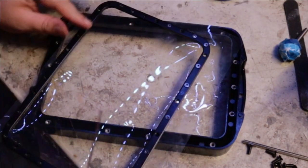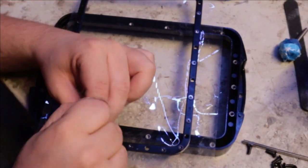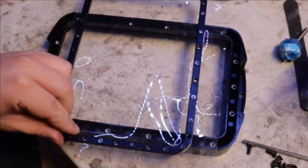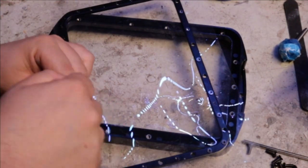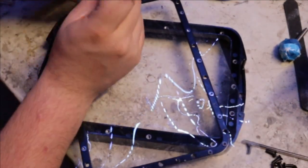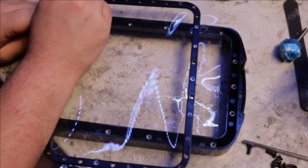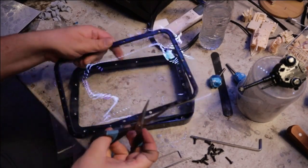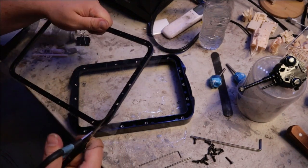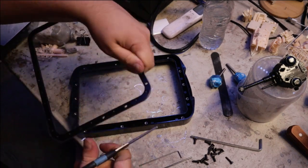It is important to maintain high tension. When replacing the bolts, start at the outer corners — complete opposite from each other in a star-like pattern. First loose, then tightening at the end. The same mechanical approach of even pressure as if you're replacing a car tire or a motor block. You will need to poke holes through the FEP film via the Allen key through the threaded hole — it can be daunting, but the only way to get a tight thread through. Optionally, you can cut the excess film around the frame for a neater appearance and easier pouring of resin.